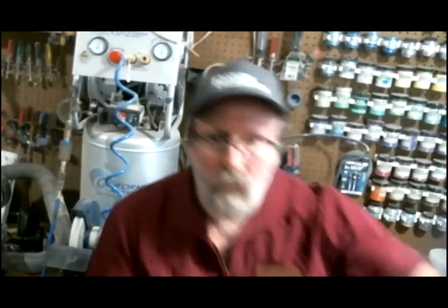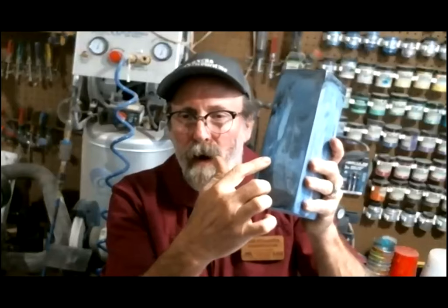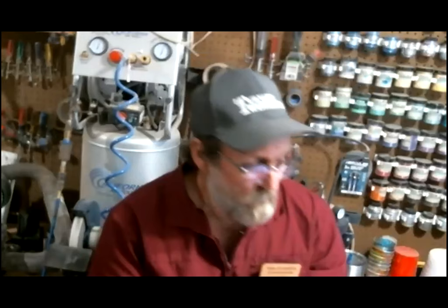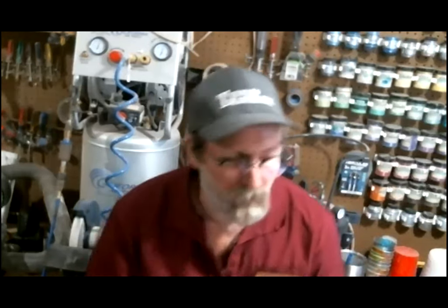So then I would be using, personally, I do a lot of those holes just with CA, thick super glue. I use thick for the most part. And obviously I have all these mica powders. That's what you see here behind us. If it was a colored blank, and it's blue, then I would use some blue mica with my CA. So what I would do is put the mica in the hole, and then I drizzle either thin CA or I mix up some thick with some mica in it and just fill that hole with it. Spray it with activator, and then 5 minutes later, you're turning your piece. That's my way that I fill a lot of open voids. If the hole is bigger, then I would use like a 15-minute epoxy, or you have to do multiple coats of CA.